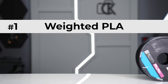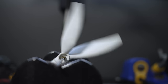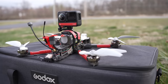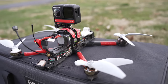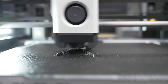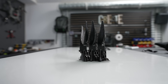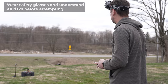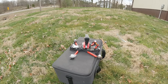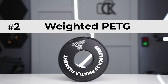The first set of props are going to be for our 7-inch quad and use putty as a counterweight. You can easily find this putty on Amazon for only a few dollars. We're using PLA to get us to failure the quickest. Unfortunately, PLA is also one of the weakest materials we could use. You'll see a theme here: design, print, fail, redesign. This is my favorite way of designing something and the reason 3D printers are so revolutionary. We can make adjustments and be ready for another failure in a matter of hours, not weeks or months.